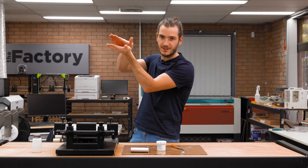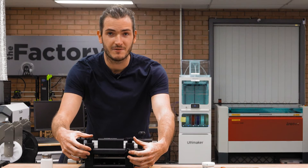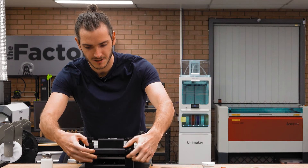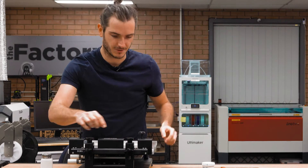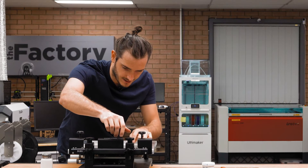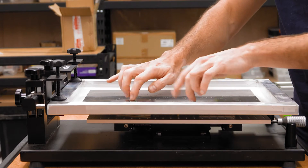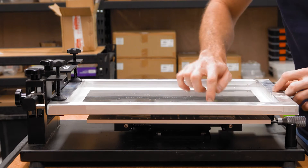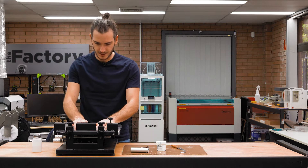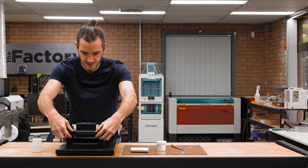If your hinge is too low, the stencil could separate at the far end. To adjust the height we have four screws — the locking screws, which I'll unlock, and then the height adjustment screws. I'll change the height on each side and perform a little tap test and listen for any drumming. If there's a gap between the stencil and the panel the sound will change. That all sounds pretty good, so I should have a level stencil — I can lock those screws.